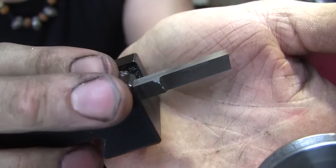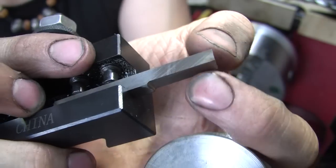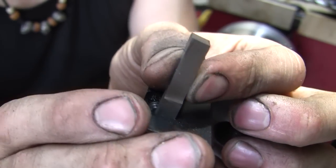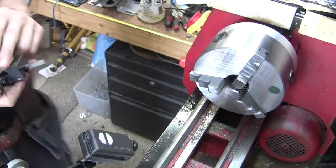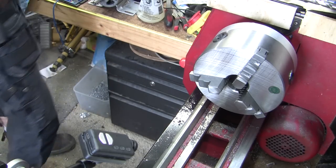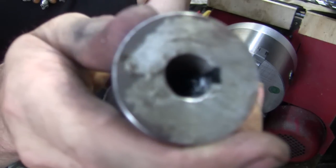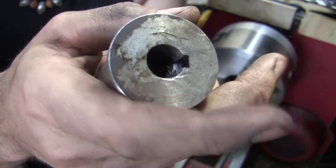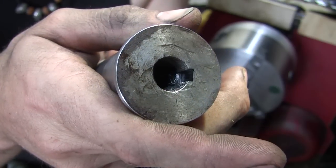Well, that's the tool that I've ground. I had to grind it just to get 5mm width on it. It's got a little bit of relief on the end and I did a test cut with a very similar tool on a piece of steel. It didn't do a bad job. I wasn't getting all the way through and there was a fair bit of flexing in the tool, so we'll see — here we go.